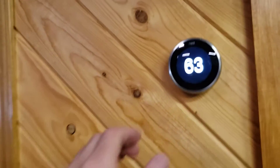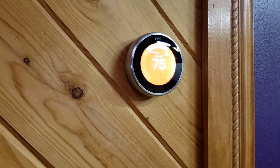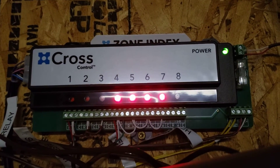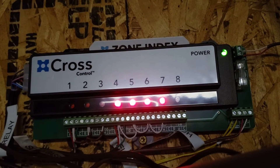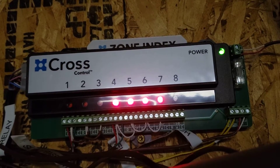I'm going out here to this thermostat and I'm going to just crank this up. I have that set to 75, just cranked it up. So if I go back in, one thing I want you to notice is the lights associated with that zone came on. You can see how the wires are daisy chained there because it's opening multiple loops or multiple valves. If you need to open multiple loops, you just daisy chain them together. Hopefully you can see that arm movement in there. And you can see it did open that one already to blue — so that line is open. It has only opened one so far.